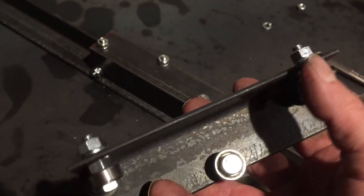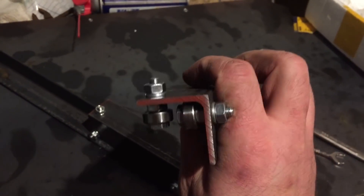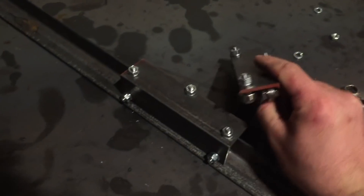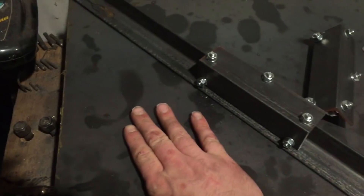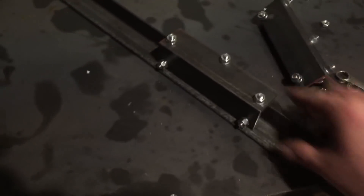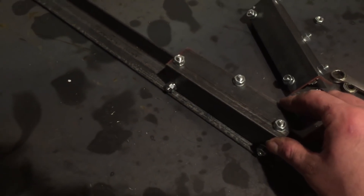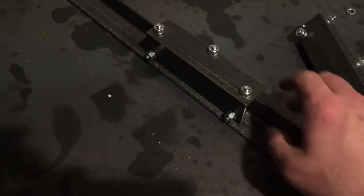The setup has three bearings on this part of the plate — the rail slides in between these three — and then two on the other plane act as retainers, preventing the rail from shifting sideways. The gantry itself bridges both carriages, holding them tight up against the rails on either side of the foundation, giving us the cleanest possible lateral movement from the cheapest possible setup. They're cheap bearings, but if you pick through and find the ones that move best and give them time to break in, they're going to work out great — and there is no movement: they are rock solid.